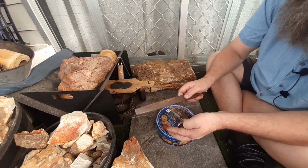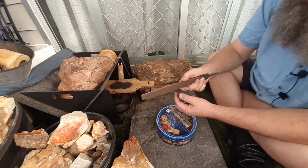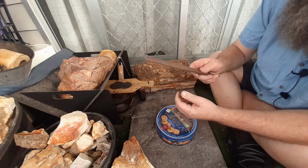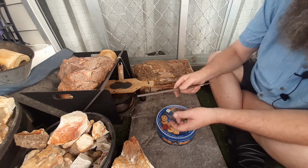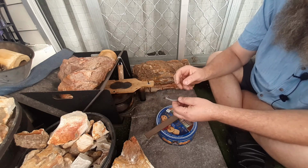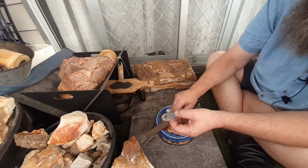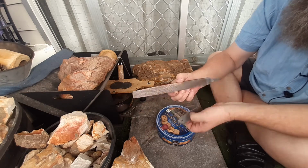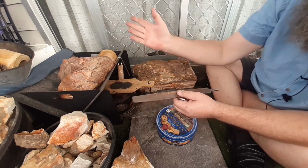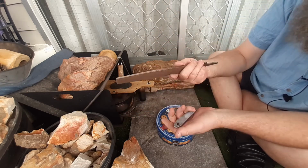They're quite hard. But what I was saying about quenching is that these are made as a tool. So while they are quenched and quite hard, they still temper them so they don't break. If you drop them, they will break, but not as often. Whereas if you quench one yourself, I put that in the quench tank straight into water, and it's as hard. This one will be harder than that because that was quenched in water, whereas this was probably quenched in oil and then put in an oven and tempered. So it was probably taken to about 65 Rockwell and then brought back to 61 Rockwell.